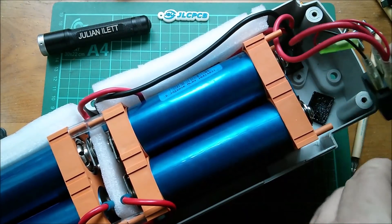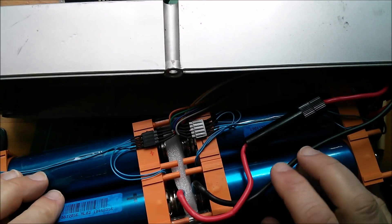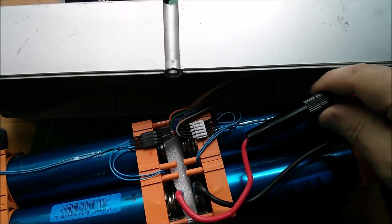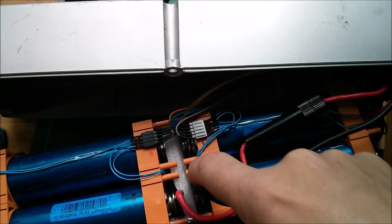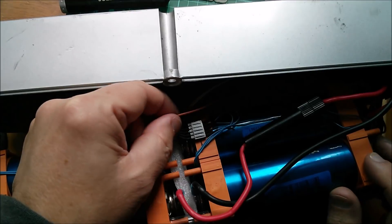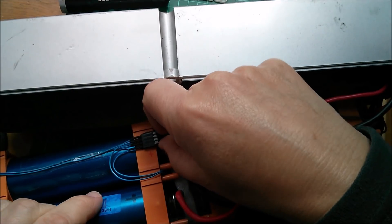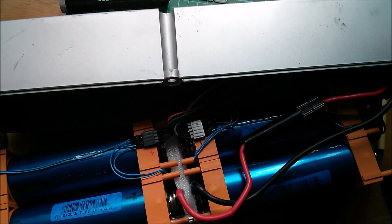That has given me access — it's not as bad as I remember it but it's not very good either. I can separate the positive because it's on a fuse. The negative though is bolted into this cell, so I need to split these to get to that bolt — it's soldered onto the connector on the battery box. These balance leads have plugs and sockets which are not ideal because that's going to add extra resistance from the point of view of balancing and measuring.